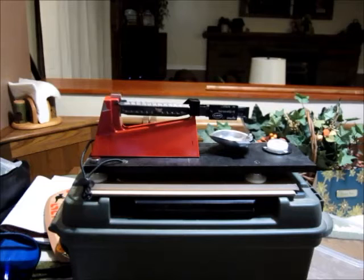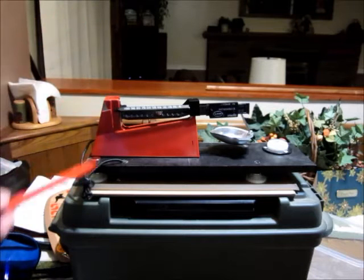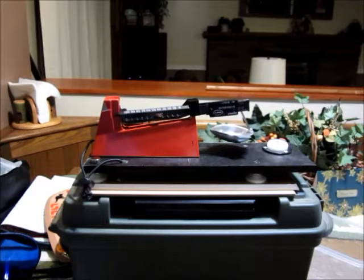As you can see it moves much more slowly and smoothly, and still comes to rest just as it normally would. The old buffer would just allow the beam to bounce back and forth repeatedly. In this case it was a simple modification, though getting them in there was kind of tricky — I recommend doing it one at a time because they like to snap together. But that really helps in terms of making the scale more readable.